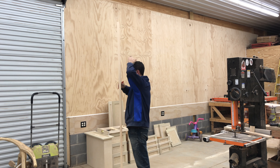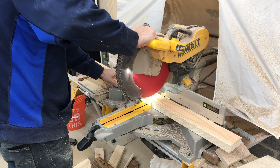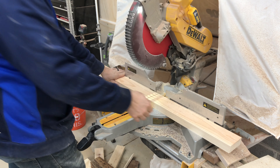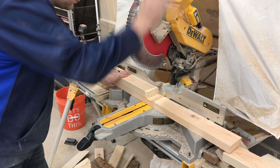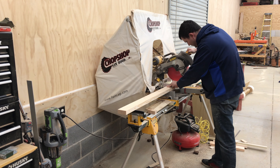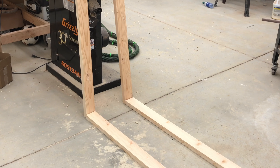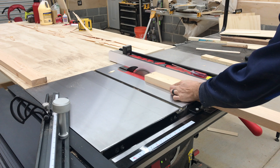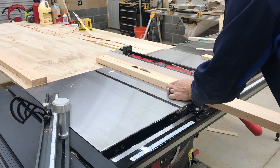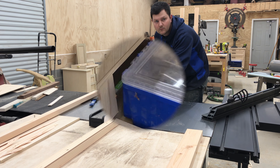The first thing you're going to do is measure the height a little bit taller than you, because chances are you will be the goalie for your kids and you don't want to be hitting your head. Now I'm cutting those to length, then I take the next 2x4 and cut it perfectly in half for the back posts. The other two 2x4s I rip in half at the table saw for the back top and sides, and we're going to join these with pocket holes.